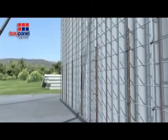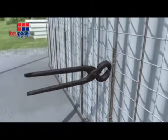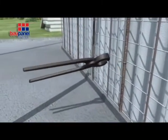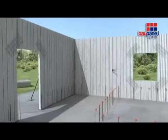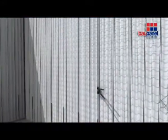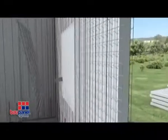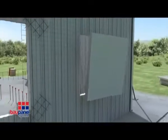This job can be carried out using automatic tools or simple engineering pliers. Once all the vertical walls have been installed, the next step is to cut out the openings for the windows and doors. Alternatively, you can cut out the positions in advance before the walls have been erected, depending on your preference. This allows you to implement changes to a job on site.